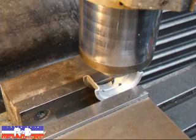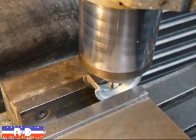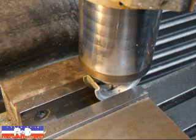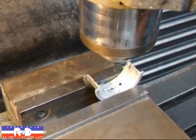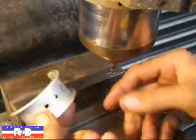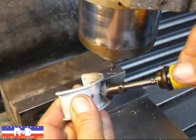I've set up the last bearing in the vise and I'm making sure that my drill is going to be in the middle. I'm using about a three millimeter drill to drill the hole. One thing you want to do is on the back side there's going to be a burr, so you take a chamfering tool and just take that out.